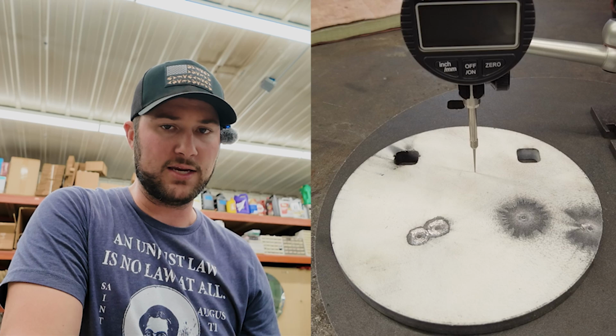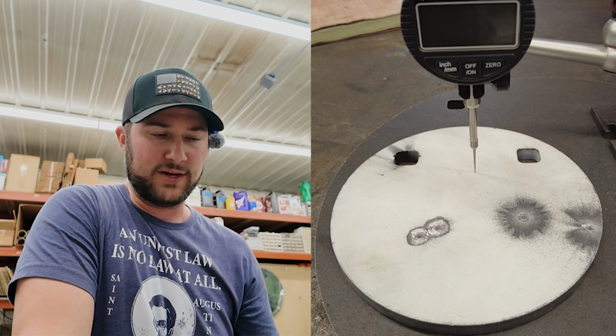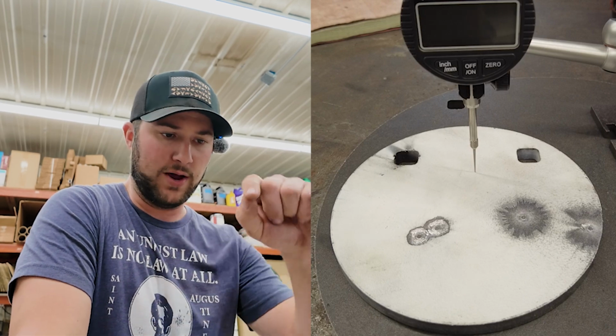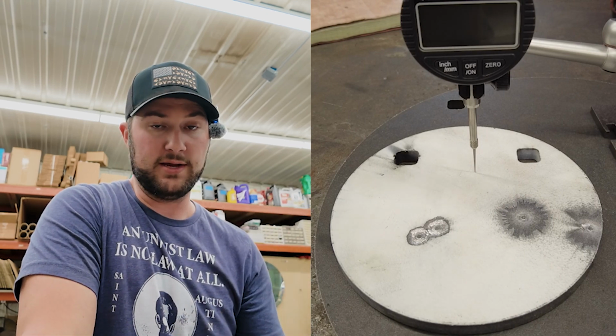So if you've got that, you're definitely going way too fast. If the massive pit on the front wasn't obvious, when you start to see that deflection on the back, that's a hair's breadth away from knocking out a slug. It'll knock out a slug around there, where that's dimpling, it'll fracture around that, and that'll pop out the back. Not necessarily the first time you hit it.